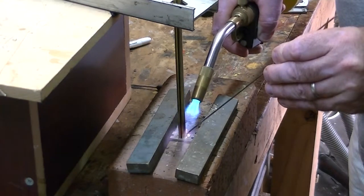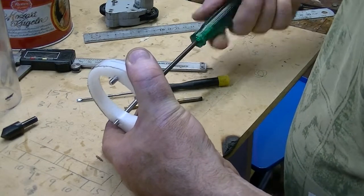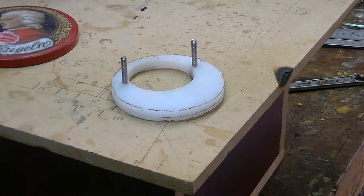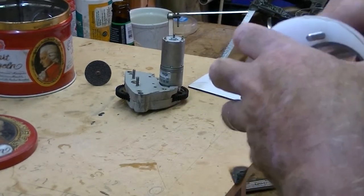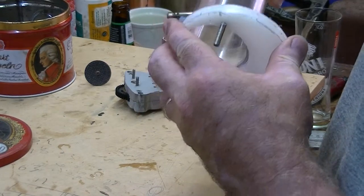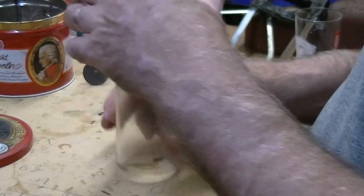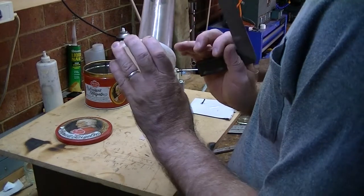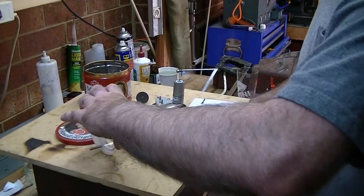Silver soldering this on. Using the Dremel to cut a slot out of the little plate at the end as well, otherwise that would be a problem. Using the same gluing-in process on the internal baffle so it will hold the gearbox. Checking the size and making sure the screws don't foul the cylinder. Epoxy is applied to the cylinder and now installing the cylinder to let it harden, having scored the outside with sandpaper so the epoxy has plenty to stick to. Using a set square to make sure it's all square — very happy with the result overall.